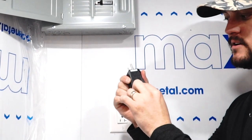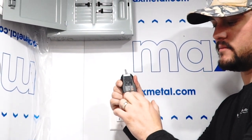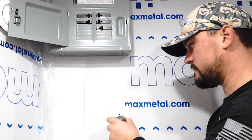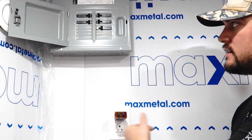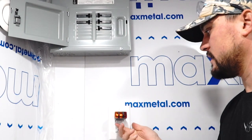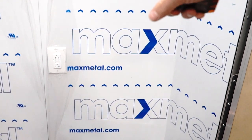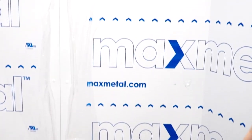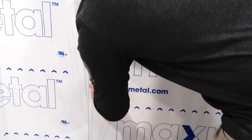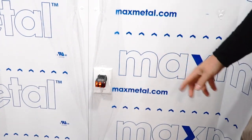The outlet tester has a table with different combinations of lights to tell you if there's an issue and what it is. If the two orange lights light up, it means it's correct. I've got this circuit here with the breaker turned off - going to plug it in. This is one of my GFCI outlets - flip it on, both orange lights come on, so that's good. On my switched outlet for my water pump, I've got the switch powered off so there are no lights, and then when the switch is turned on we've got power and that's connected correctly.